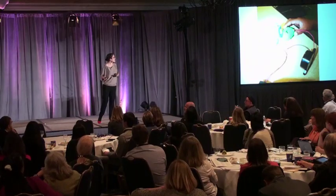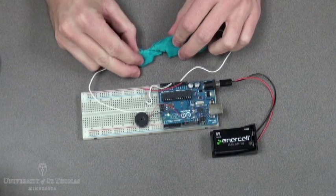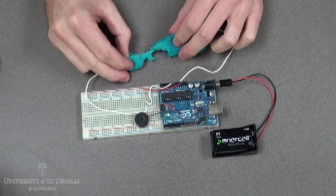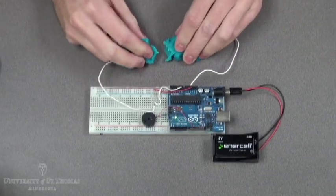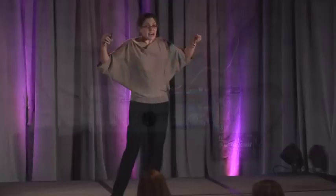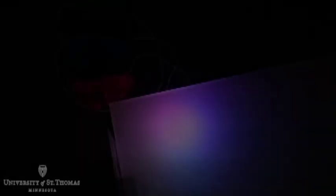We started having upper-level teachers say, 'Well, what could we do if we added microprocessors?' And that became an interesting thing for us. As you use more dough, it's longer and more resistant. Because the longer the piece of dough is, the higher the resistance — and if you measure the resistance, you could do that. Similarly, if you're teaching about light mixing with RGB LEDs, we thought, could we build our own little light mixer where to change colors, you just play with the Play-Doh? So we have three Play-Dohs — the color doesn't matter, we just color it so it's easier to control. As we stretch them, it changes the lights, and by lengthening the red and changing the ratio of red to green or blue, we can change the colors that come out.